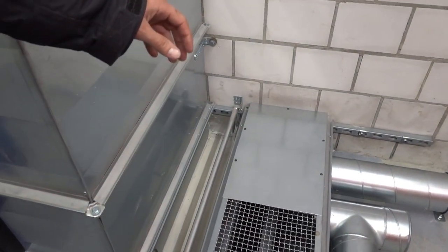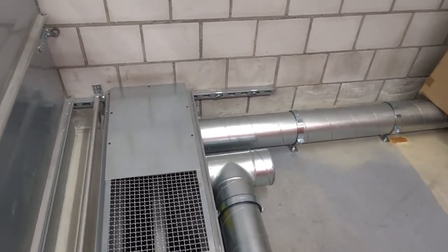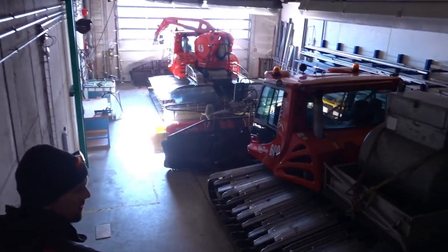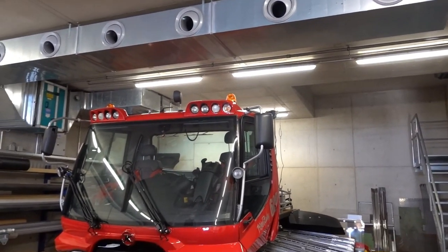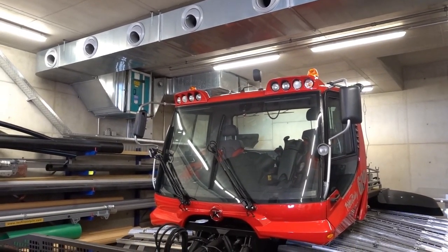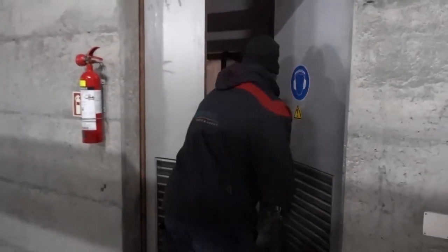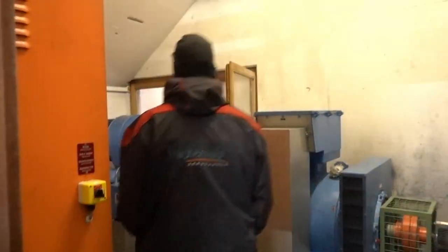The reason why this room is under low pressure is because for cooling, the air is not pushed into it but sucked out of it. The exhaust air is then pumped into the snow groomer garage where it melts away the snow from the snow grooming machines. This way the heat produced by the converters is not even wasted. After enjoying this modern solution, let's look at how the 1986 chairlift drives its motor.